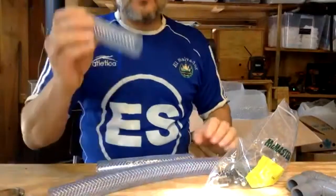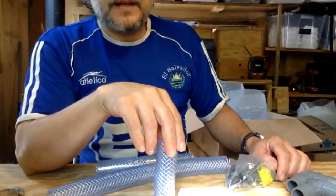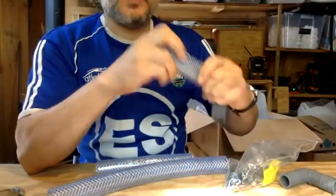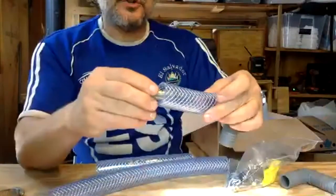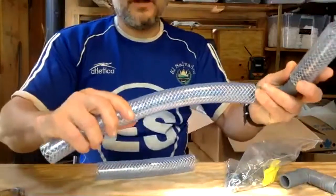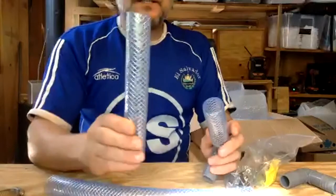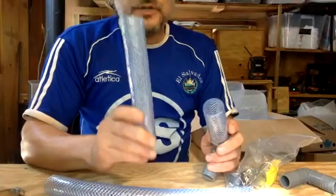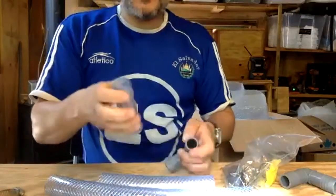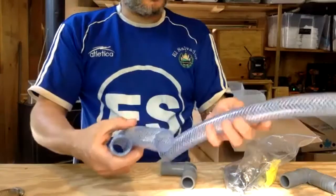And then you should have 3 pieces of tubing in there. One of them is small, and that is your primary drainage. So the nipple drains into the small piece, and then you have a long piece that's the throw to get it out of the toilet. And then you have this medium-sized piece, which is going to drain you down into your container. So three pieces of the 1 inch tubing.